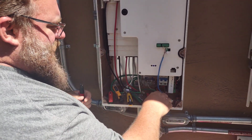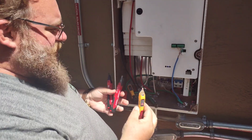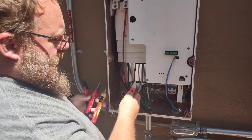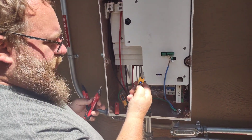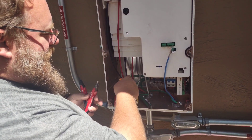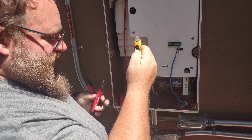Now we get into our two nicer, higher-end ones. These are dual voltage — I'm still on the fence about recommending dual voltage for anyone unless they're a professional electrician who really knows what they're doing. Here's the one thing I hate about this system: remember the one that had to be held on? If you bought that first you'd think holding down the button is normal. But on this one, if I hold down the button, the lights come on and tell me it's ready to go, but if I hold it up to everything, everything reads dead. If I let go of the button it detects correctly. Holding down the button defeats the device — this is a way to get yourself killed.